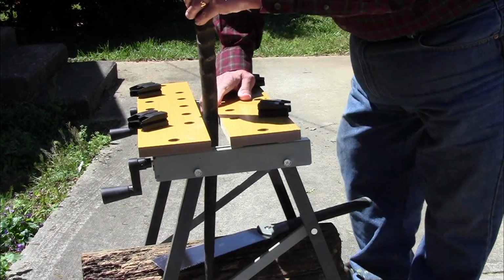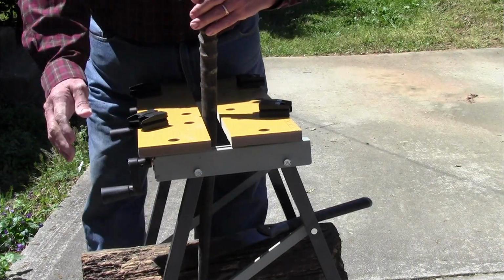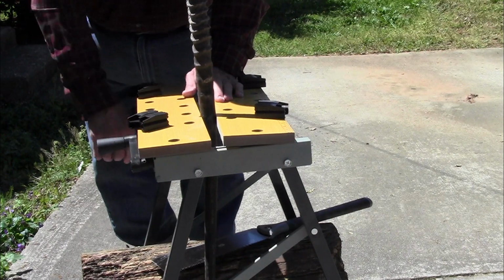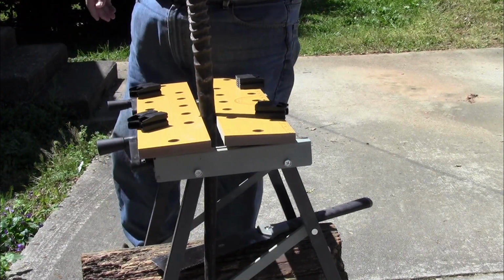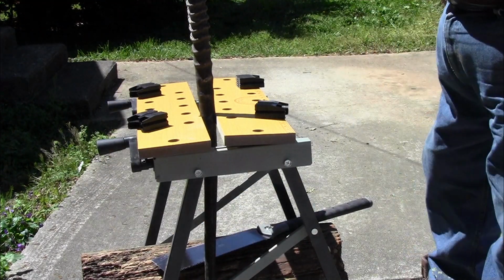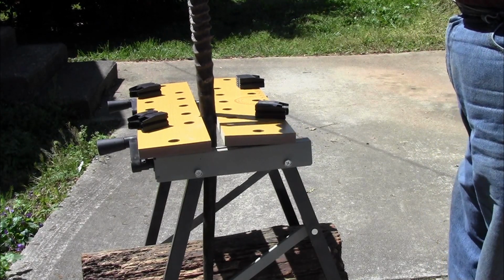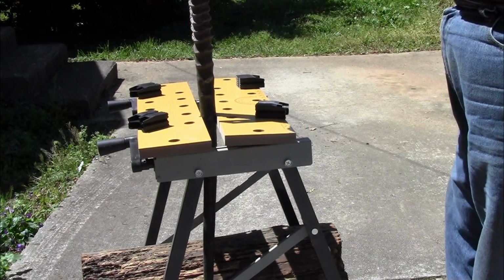With the guide cuts made on either side of the Oryx horn, I can now saw it straight down through the length of the horn until we get to that area where the tip is so thick it's not going to be useful as a bow belly liner.